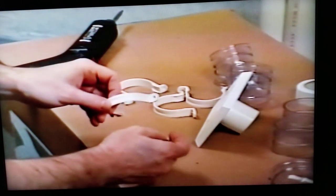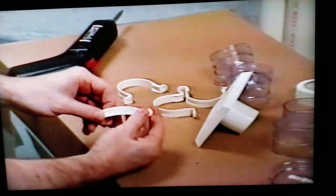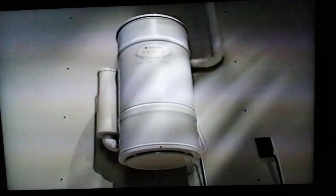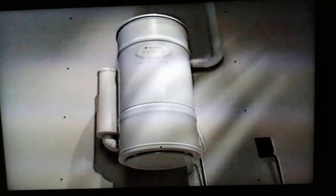The pipe will normally run below the floor joists or above the ceiling joists. These unique hanger straps accommodate nails or screws, slip over the pipe, and keep the piping neatly and permanently in place. Once all the inlet valve branch lines are connected, run and connect the main trunk line to the power unit location you selected during the planning stage. If you're mounting the central vacuum power unit in the garage, first drill a pilot hole with a coat hanger drill to check location and for obstructions. Then drill a two and a half inch hole through the wooden joist above the masonry wall between the basement and the garage.